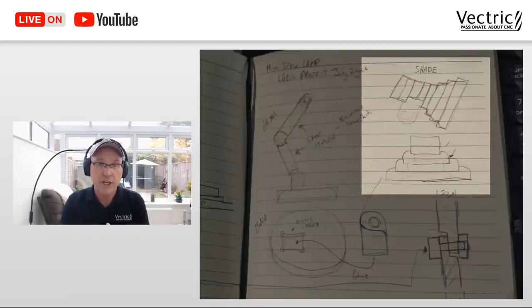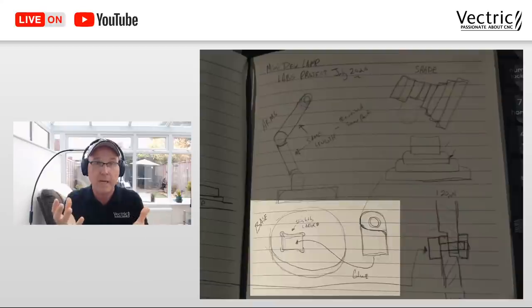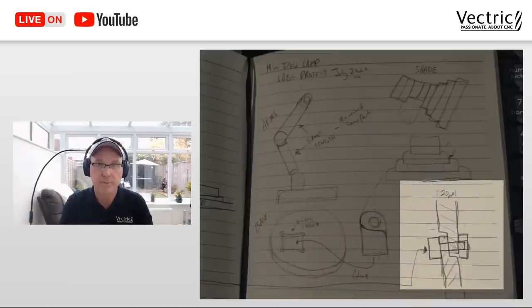I needed to build a shade. I wanted to focus pretty much on the idea of profile cuts and the molding tool path, which is what this turned out to be. And also I had to plan to have part of the armature stick up inside of the shade. I needed a base. And the base had to have a spot to put the armature into, and I decided that I was going to do dog bone fillets to make it fit.